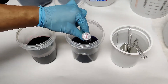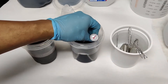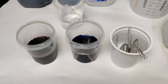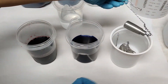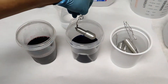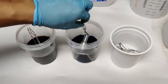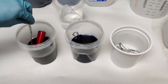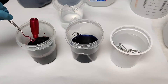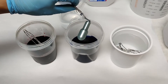Here I'm checking the temperature of the dye to make sure it's not too hot — if it's too hot it'll start sealing the part prematurely and none of the dye will get absorbed. I usually shoot for about 120 degrees Fahrenheit. Caswell recommends about 140 degrees, but I like to play it safe and give it a longer soak. The red dye is already leaching in nicely; the blue, not so much.